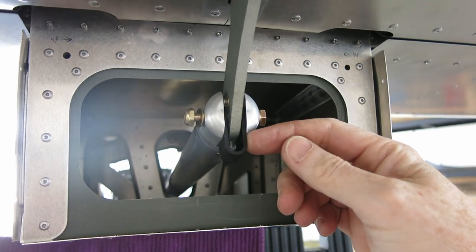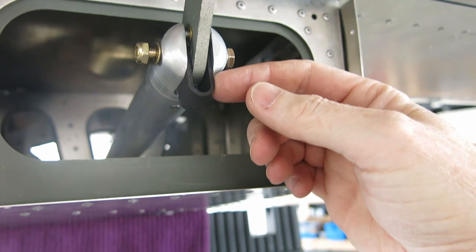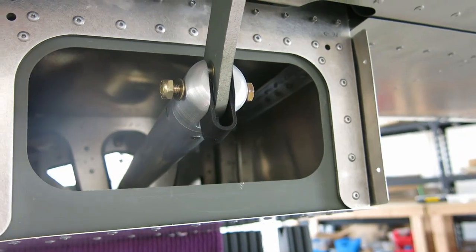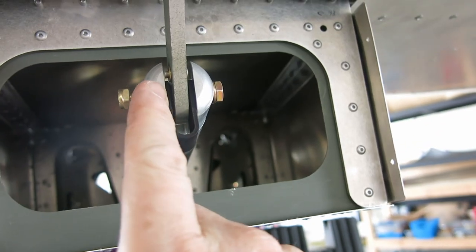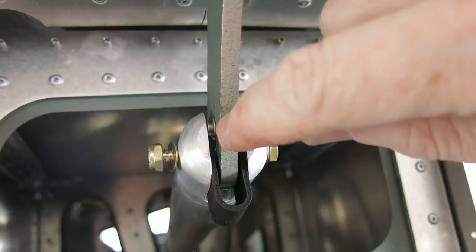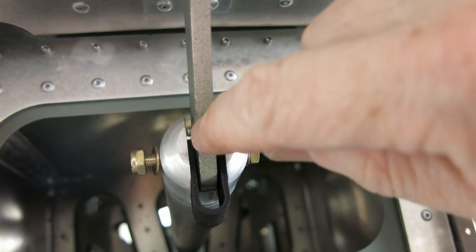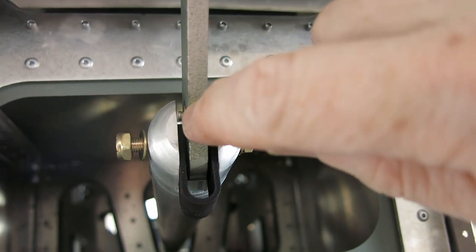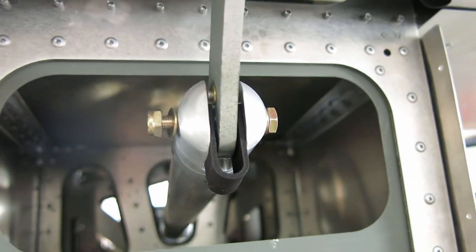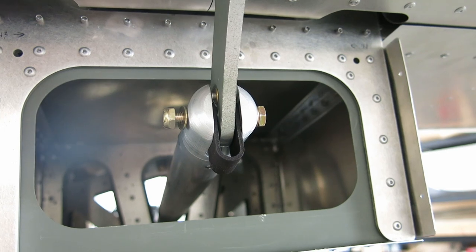I don't know. The only thing I would say that I kind of, not struggled with, but a tip on this is, when you put it in, just use a drift pin to get that lined up in there. Also had to file that bearing retainer rivet, the end of that rivet. I had to shave, I don't know, 1/10 of an inch off of there maybe to clear this push-pull tube. So we did that, and everything seems to be working okay.